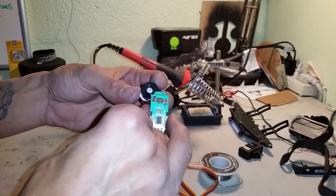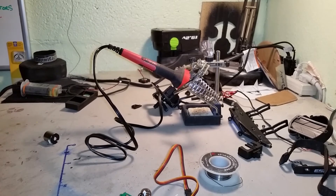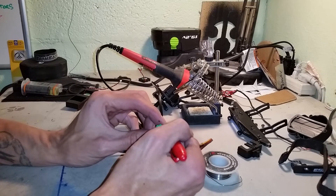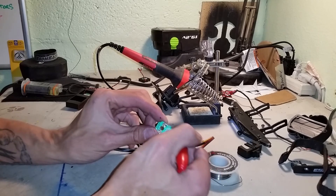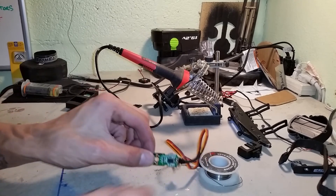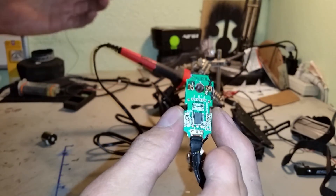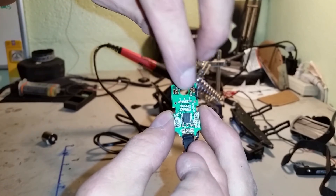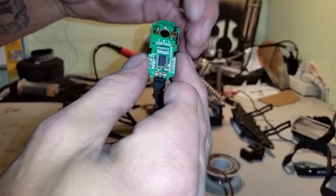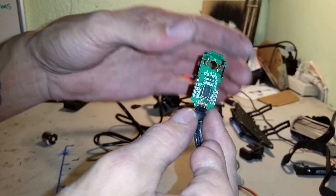Do a double check for what you're doing before you try it. I'm going to get a sharpie and mark on here real quick which was positive. Now that we know that's positive and that's negative — basically from here on out this is what you have left, and you want to solder, for example, a JST plug to the tabs where the motor was, and then you will have a winch controller. Once this is dry, clean it up, waterproof it, wrap it in some electrical tape — make it a nice little controller package.